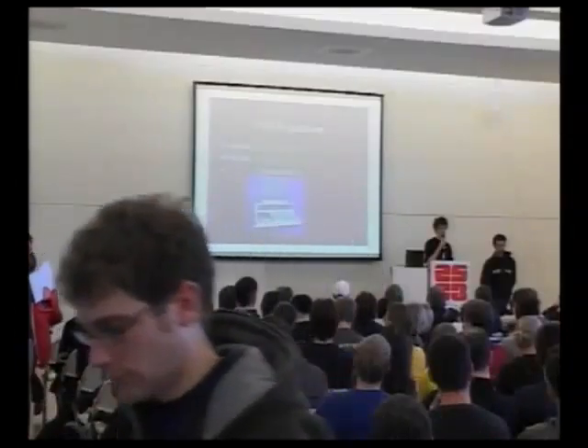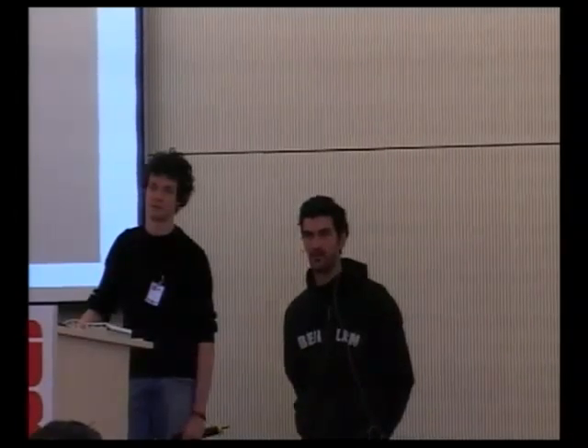For the sniffer mode, do I need the NEK — the network encryption key — to do sniffer mode? No. What do I see without the NEK? You see unencrypted packets. Actually, you don't see all frames from what we have seen. It's mostly management frames — everything related to MAC access to the medium, which is in clear, is available to the sniffer mode.